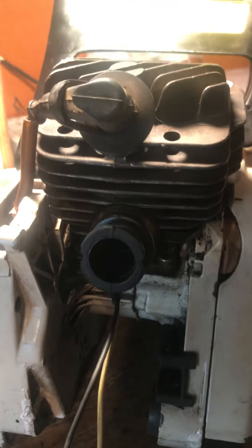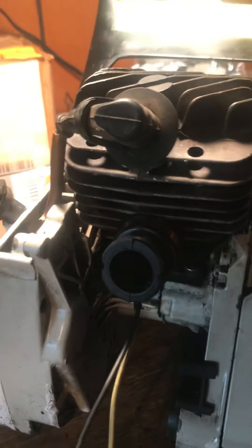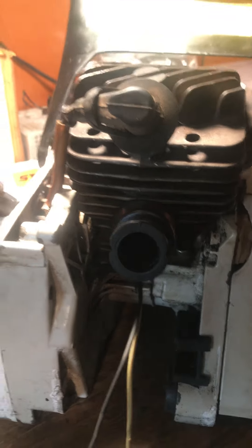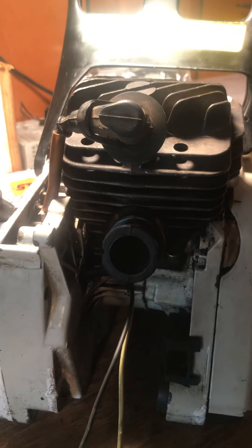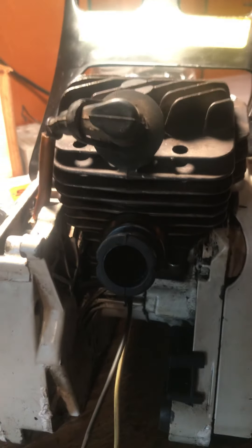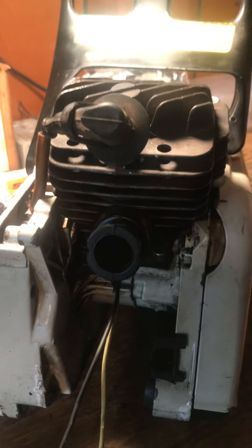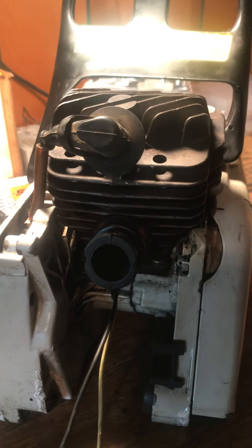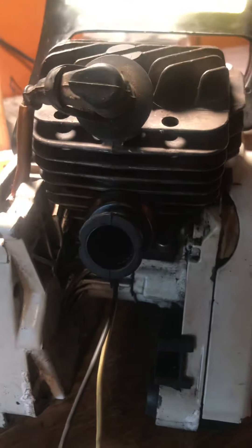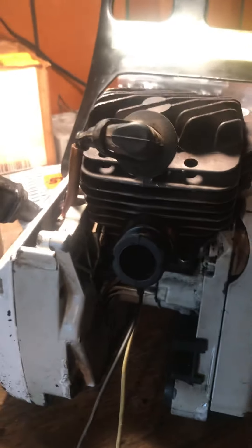The 462C I think is 5.9 or 6.0 horsepower, and they have the 044 listed at 5.1. But the more of these saws I run — especially the Husqvarnas, though I'm primarily concentrating on Stihl because I like their product — some of those Husqvarnas are rated at 6.5 horse, but you can put a huge bar on them and they pull. So I don't know if the horsepower ratings we're getting are really accurate. I really don't think so, especially with the Husqvarnas. The Stihls are pretty close.